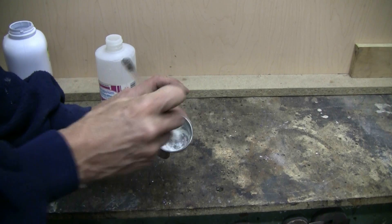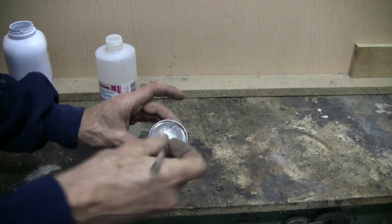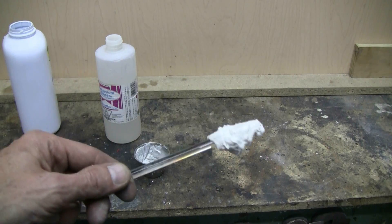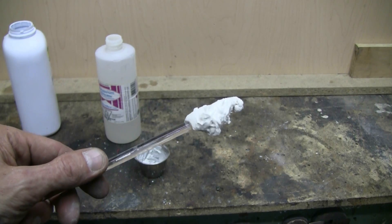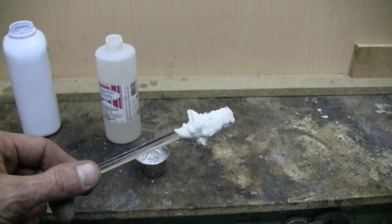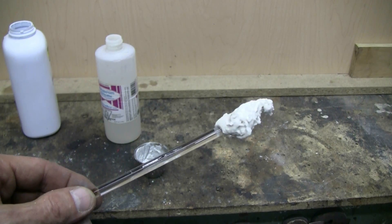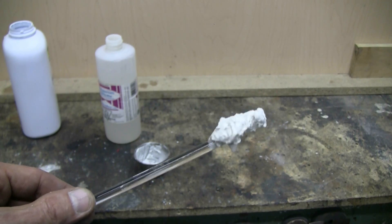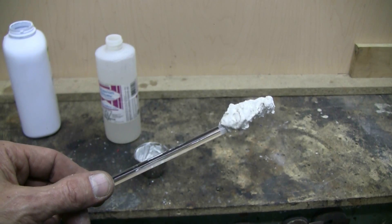Because the liquid is so thick it's going to take a while to mix the extremely fine talc powder into the silicate. We're starting to get gooey here and we've reached a cement-like consistency in just a few seconds. What I have on my stirring rod here is a very high quality refractory cement that, when it sets up, will easily withstand the furnace temperatures needed to melt copper and brass. So if you can't buy it or don't want to buy a large amount, you can make a very high quality refractory cement yourself from these two ingredients.